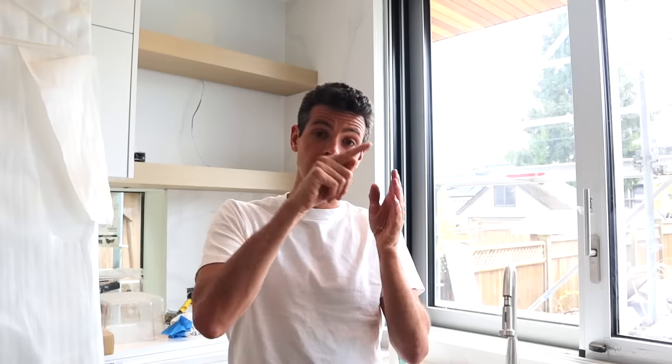Have you ever noticed when you caulk something, how it goes in like all squiggly? So what that means is that behind your smooth line, it's uneven depths. And so when it shrinks, it'll actually show that squiggliness. Ask me how I know. I've caulked things that were way too big to be caulked without a backer rod, and then had my work look just horrendous.